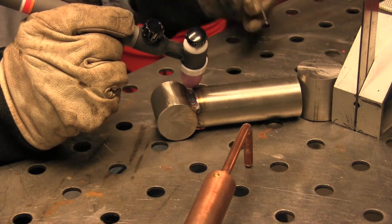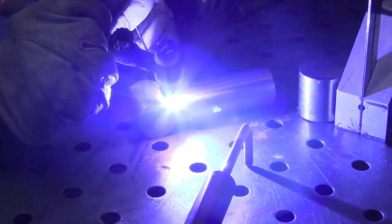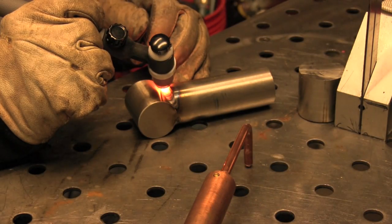I am using a foot pedal here. I talked a little bit about the foot pedal in part one of this, using the Lincoln 210. It's lift arc TIG, so you have to touch off to get the arc started, but it touches off at really low amperage, so it makes the tip of the electrode last a little bit longer than a straight-up scratch start rig — but really not much difference between lift arc and scratch start in my opinion.